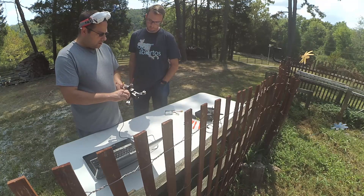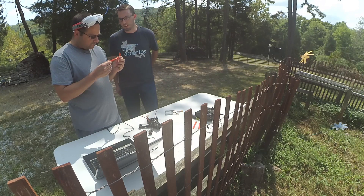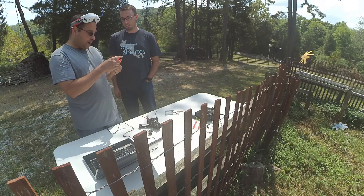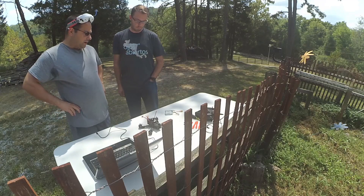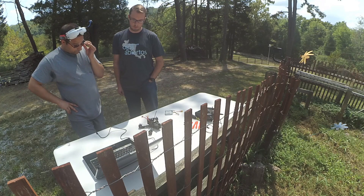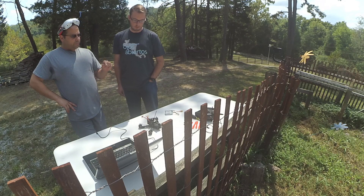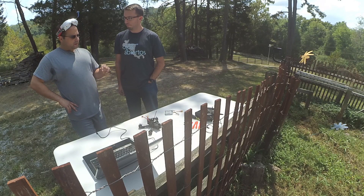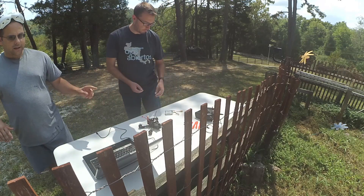So the bottom line is these motors are fine. Then we can think about your props. I've tried different sets, same style, but from different batches, different colors — same result. These may not be particularly well-balanced props perhaps. We could try a props-on motor test with somebody holding it down and letting it spin — it's a little hair-raising. Or we can just fly it and look at what we're seeing. One thing that might be nice to do is put a high def cam on and see if we see the vibrations in both the high def and the FPV cam.